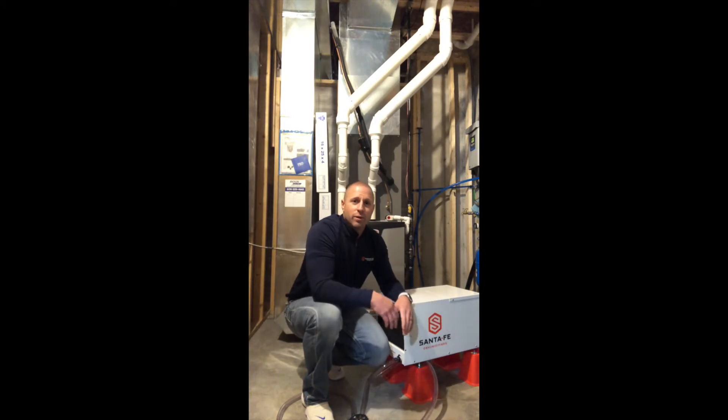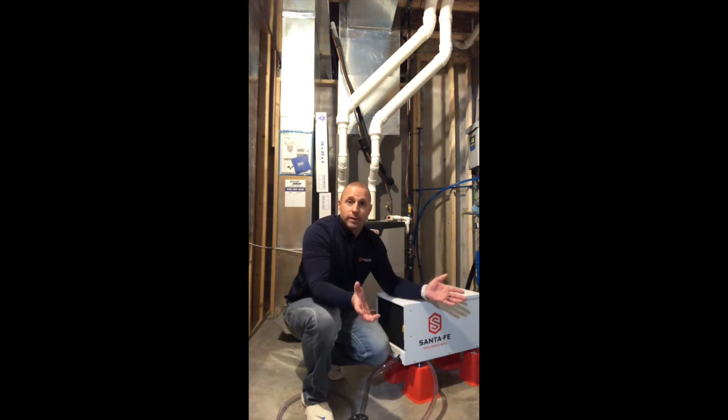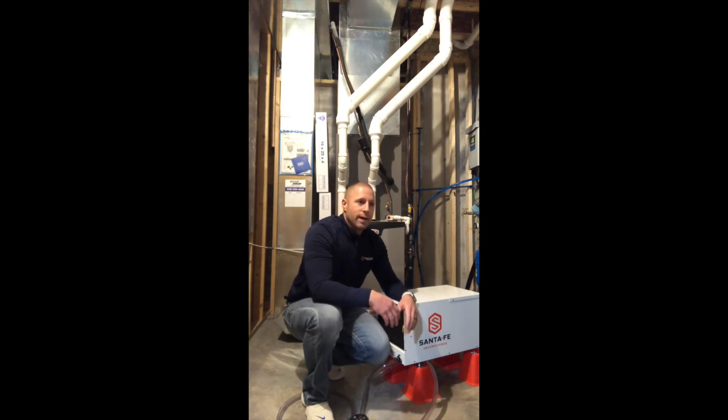In any residential application where you've got a home — I'm in my basement — you've got a crawl space, you've got a whole house. You're going to be somewhere around 70 degrees for temperature in a whole house, somewhere between 70 and 75 degrees. In a basement it might be a little bit cooler, maybe between 65 and 70 degrees. In a crawl space that could really range because you're not going to heat that space typically, so you can see temperatures down to 35-40 degrees on up to potentially 80 degrees depending upon where you're located.